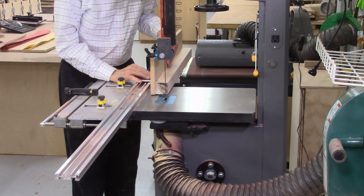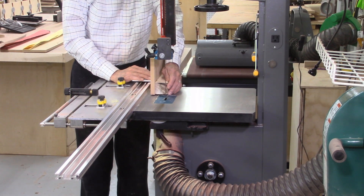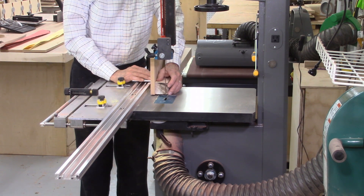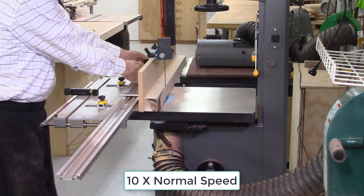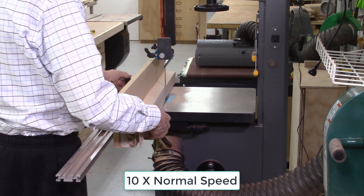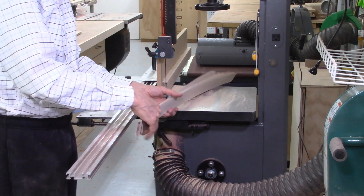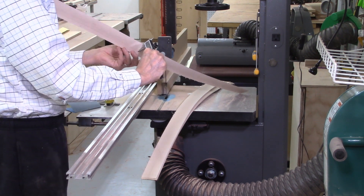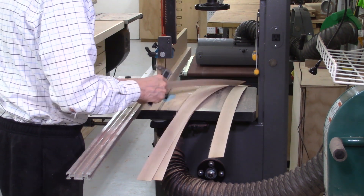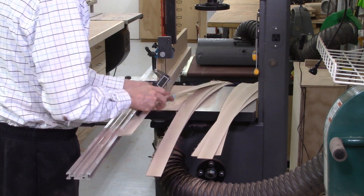Next I have a piece of maple — a thick board. I'll be cutting some boards at twenty thousandths, fifteen thousandths, and ten thousandths, then see if I can get even thinner. I sliced a total of fourteen maple boards at the twenty thousandths inch setting. All fourteen measured between twenty and twenty-three thousandths of an inch thick — again a repeatability of plus or minus one thousandth of an inch between boards.